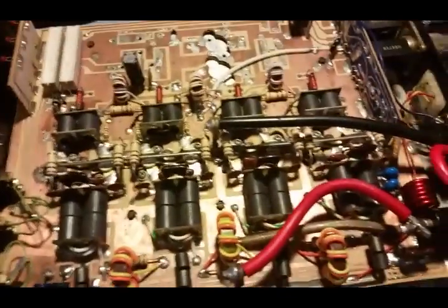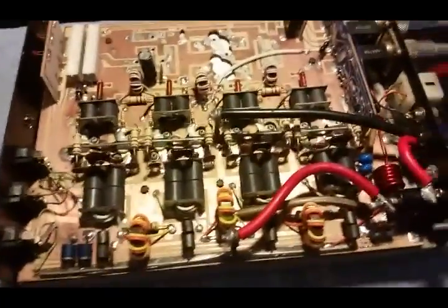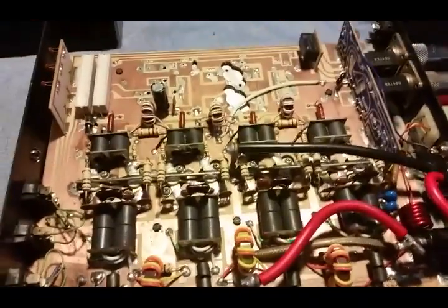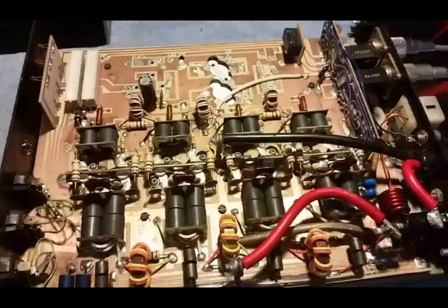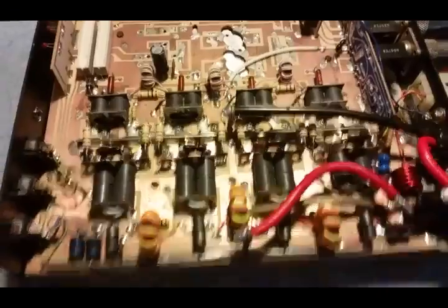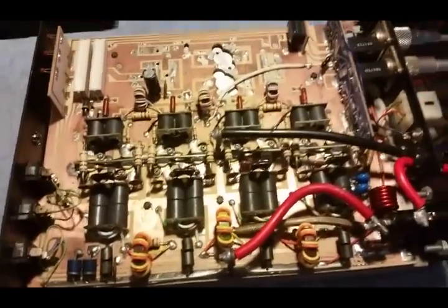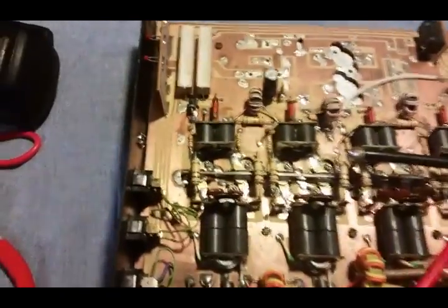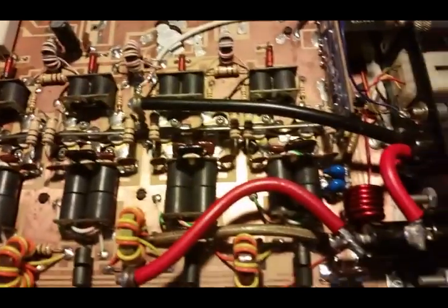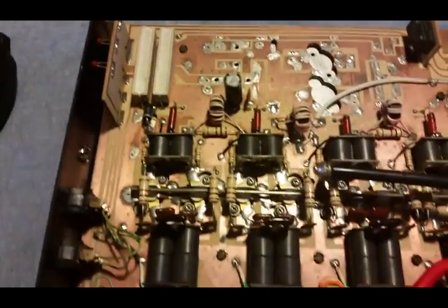Because these amplifiers are older and were primarily designed to be used with older type radios that did about four watts. But you can tell the builder understood there were radios doing more, using creative input pads in a parallel series type circuit. This one had that regular padding plus a little extra padding. This is still in Class AB mode — I just took the AB circuit for the driver out. You don't want that staying in there and continuing to get hot. I also cleaned this amplifier up — left to right, upside down — there is no flux anywhere. This thing is spotless.